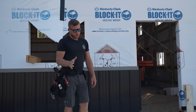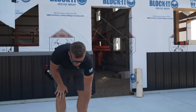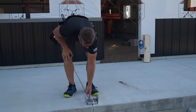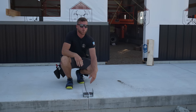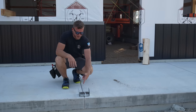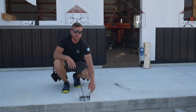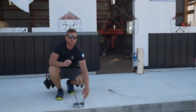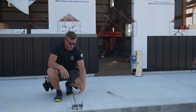It's not the end of the world. I know a lot of people are going to say these posts are not going to be strong, but this cut is about an inch thick and doesn't go into here — this is just a troweled expansion joint. So there will be a crack here, but we're going to use Simpson Titan anchor bolts, and they explicitly say they can be used on cracked concrete. So I'm not too worried about it.